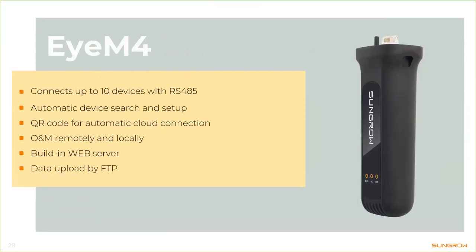The IM4 is a very special connector. You connect this adapter to one inverter and then use RS485 daisy chain to connect up to nine additional inverters to the system, so you need to purchase only one communications adapter for up to ten inverters. In Europe it features Wi-Fi access only; in China a 4G version is also available, but since China uses a different frequency than Europe it cannot be used here yet. As soon as there's interest, adding a different frequency chip inside the adapter to bring the same functionality to Europe should not be difficult.